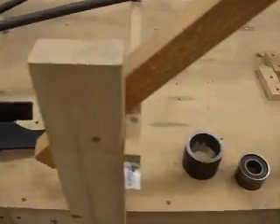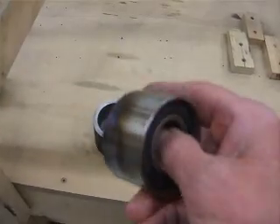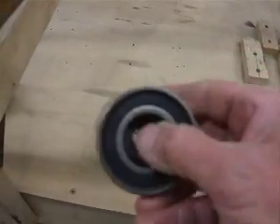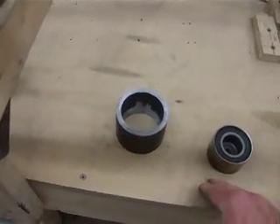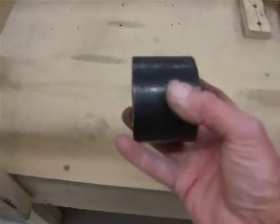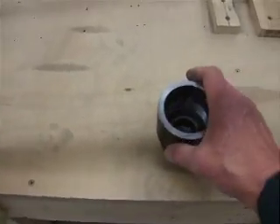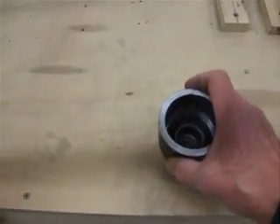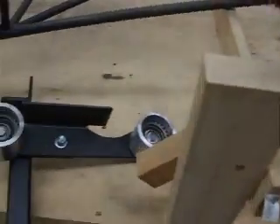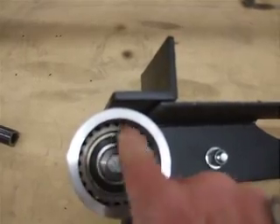How I got the idea for the little wheels was when I changed the timing belt in my wife's Subaru. They have these really thick double-race pulleys that the timing belt rides on. Those are very expensive bearings, and even though the old ones still had a lot of life, I replaced them anyway and figured I could use those pulleys for my belt grinder. I got a piece of regular schedule 40 pipe — it was just a little bit too small in diameter to fit over the top — so I took a Dremel tool and slowly ground around the inside until I got an interference fit, just enough to squeeze over. Then I pressed them in on my hydraulic press. You can see the little keyways for the cogs and the timing belt.